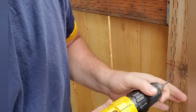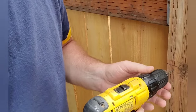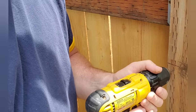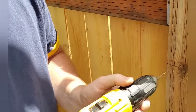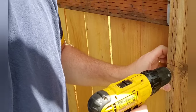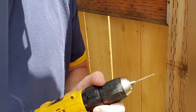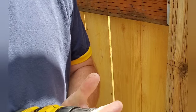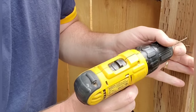I'll just show you what I'm doing — you don't need to see me go through all of them. The drill bit is thinner than the actual screw, so it just removes some of the wood so things don't splinter. If you try to drive that screw straight in it might crack the wood. I went up one size on my drill bit and went through each of the holes.